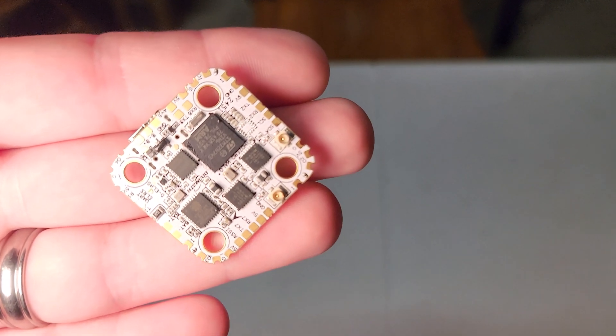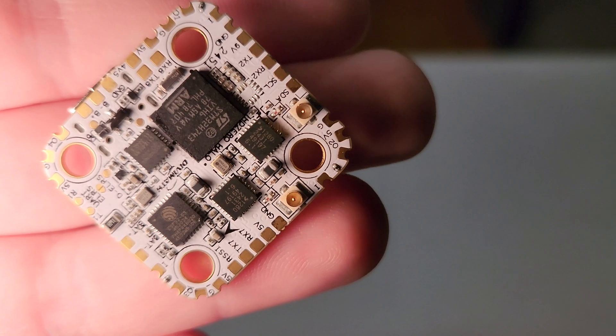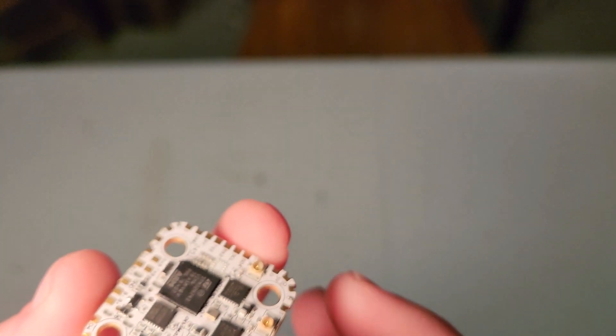This is the ultimate flight controller for anybody flying a digital VTX that needs a 20 by 20 mounting pattern. It's got everything we need for digital FPV and nothing we don't, like the analog OSD chip. Saving all that space from removing parts we're not using and putting all the new stuff we want in there, like a really powerful BEC for the digital VTX and a Gemini compatible ExpressLRS receiver. There's no soldering for the ExpressLRS receiver — it's built in.